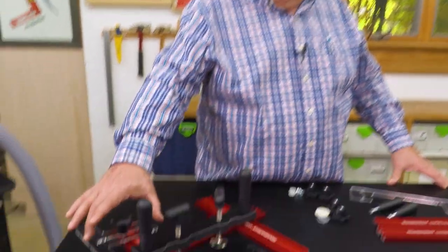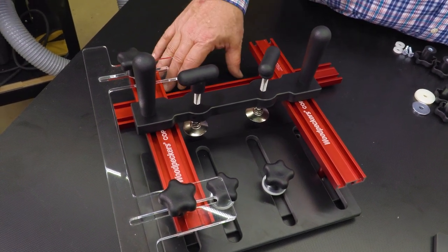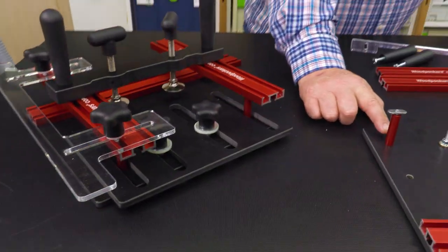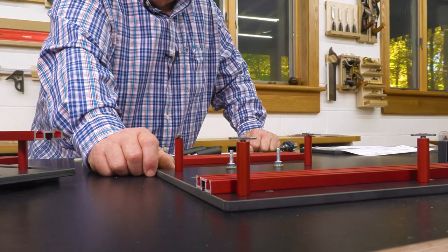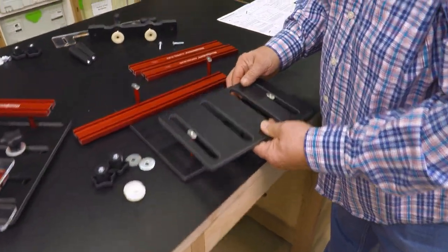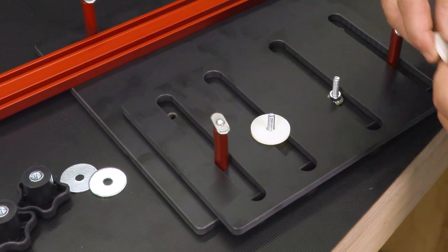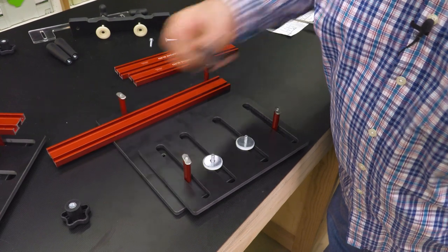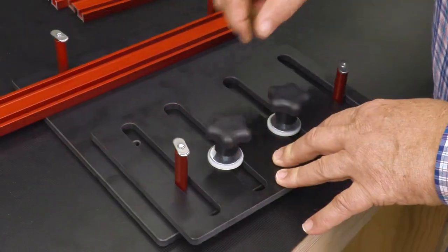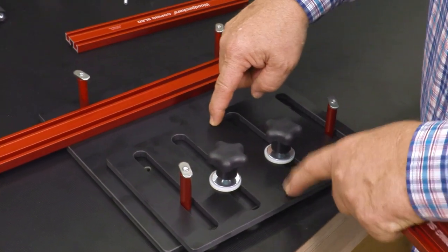The two tracks that hold the guide and the clamps are mounted above the surface of the base, and so these little risers right here are the next thing to go on. They're on flathead bolts, just like everything else, with the track nuts at the top. The next step is to install the top plate - this is one where you can't do it wrong, it only goes on one way. When you get that in there, put a nylon washer on first, then a couple of large fender washers, and our two knobs. Be sure you do that step before you install the top tracks, because you cannot put the top plate on once the top tracks are installed.